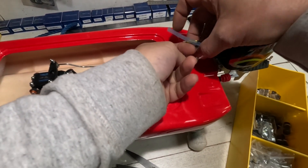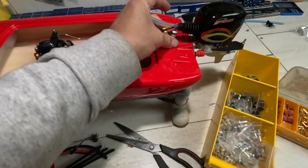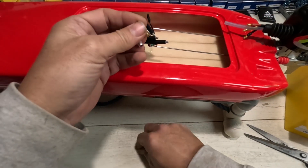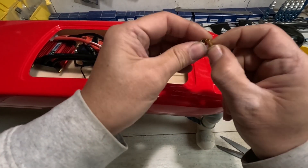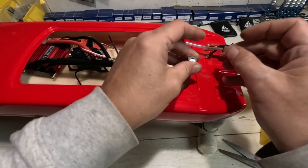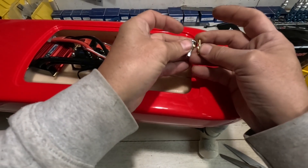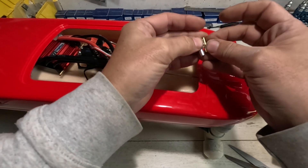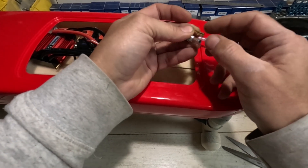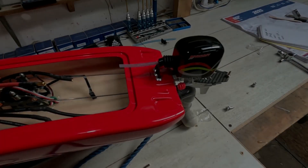Once I start drilling, it's done. So I think I'm going to change them to 4mm — I'll put 4mm bullets on here. The 3.5mm stuff is just so small, I don't know how the current gets through it. With 4mm I can drill that out a little bit, press it in, shorten it off so I've got some room — just a little bit of terminal sticking out past here so I can solder.